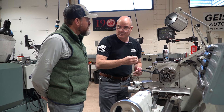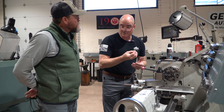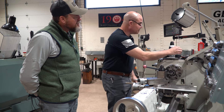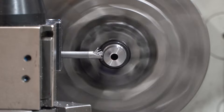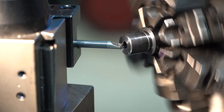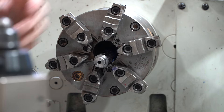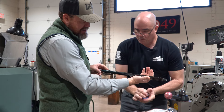I'm feeling it a little bit now — see how it's right there. You can kind of press it there. That's it. Now we don't want to go any further than that, because if we do, that's going to limit you only to this type of ammunition. So we've taken 30 thousandths off, and I need to take 30 thousandths off of the shoulder as well.